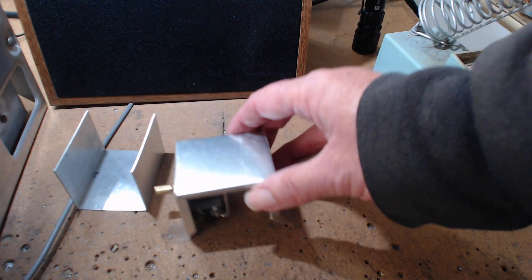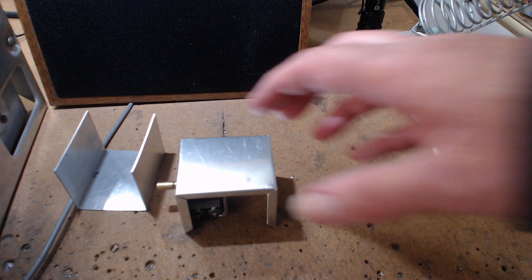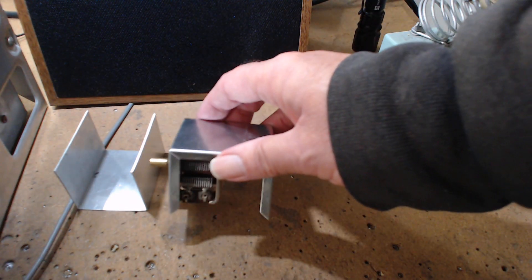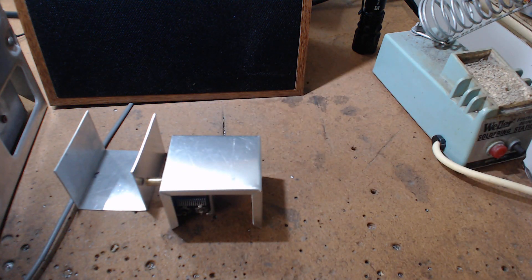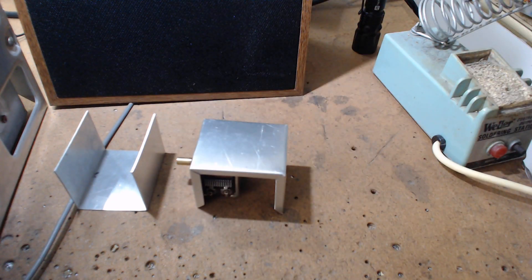You can make a pretty decent box. I won't say this is a great box, but it's going to suit my needs — building an oscillator in a metal box, running the test with the lid off, running the test with the lid on, and running a test with a PTC positive temperature coefficient thermistor. So I'll be able to do three experiments with the Franklin oscillator by building this.